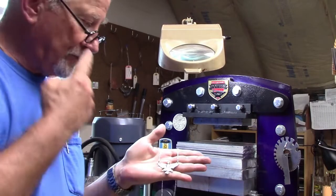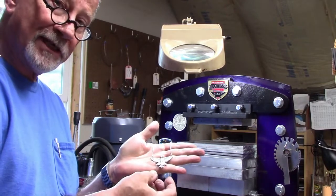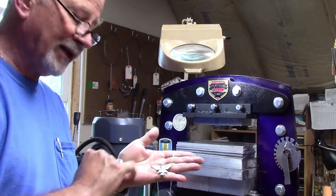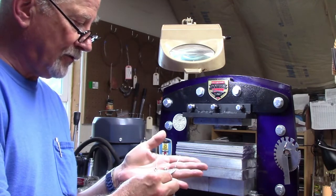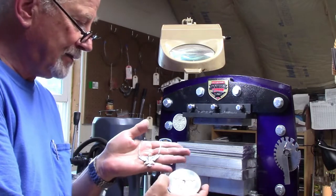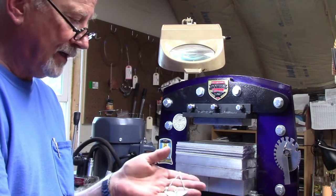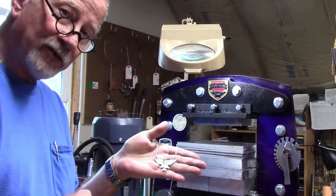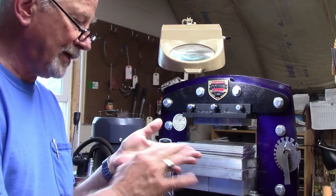What I've done with this piece is used a fine silver ingot that I rolled in the rolling mill and used an impression die to build this beautiful Art Nouveau type piece. It's a high relief silver female portrait with a stylized headdress that represents wings, and her flowing hair is down here as well. I pressed it into an impression die, and that took multiple times. Then I finished it, enameled the back as a counter enamel, applied some enamel to the wings, and set a six millimeter natural peridot in the headdress attached to a standard silver chain. Then I oxidized it and buffed it for relief.